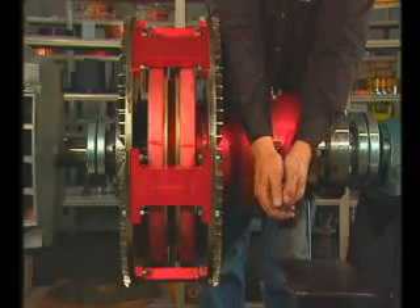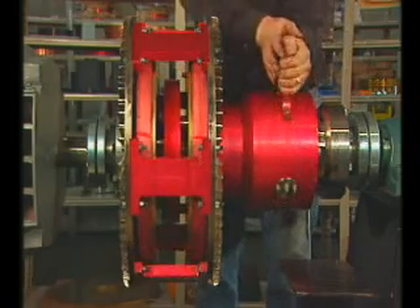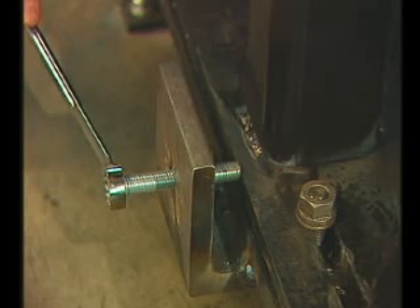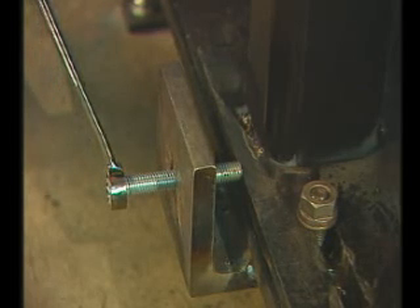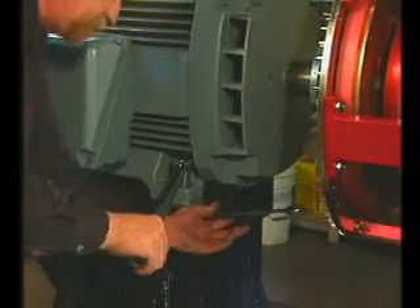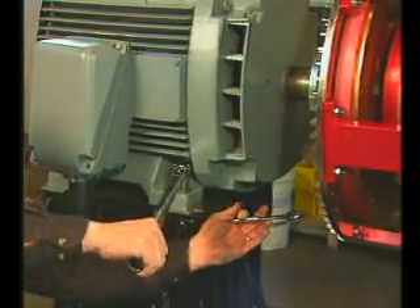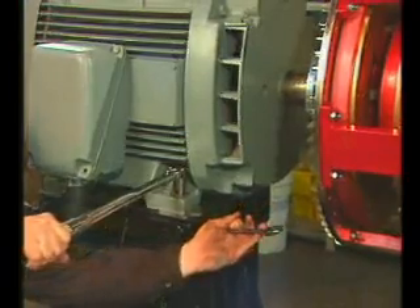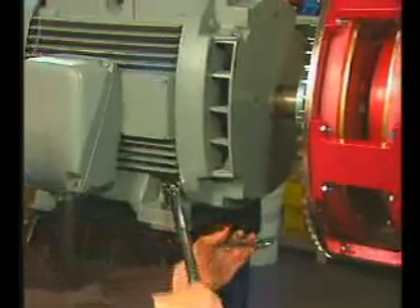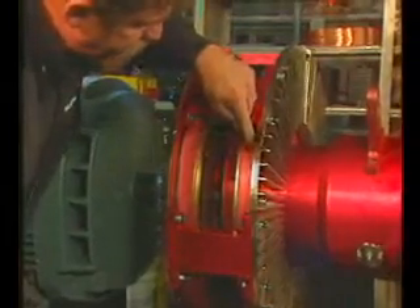Using the actuator arms, position the magnet rotors to their full-on position — this is the closest to the conductors, or the minimum air gap position. Adjust the motor feet jack screws until an even air gap between both magnet rotors and conductor plates is achieved. Check the angular alignment and shim the motor feet as required to equalize the readings. When aligning the ASD, the goal is to get the magnet rotors as centered as possible inside the conductor housing. Refer to the installation manual for a more detailed explanation of this procedure. Torque the motor foot bolts to specification and recheck the air gap and angular alignment.